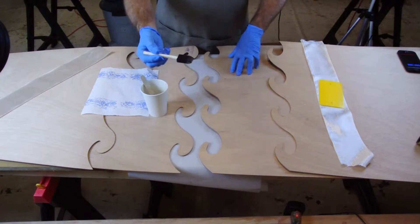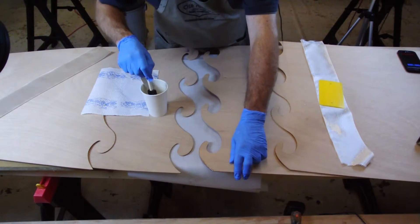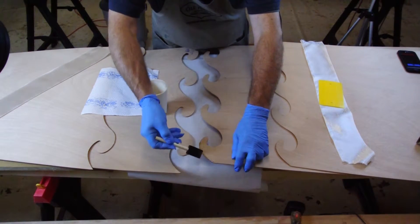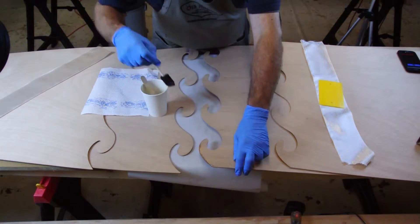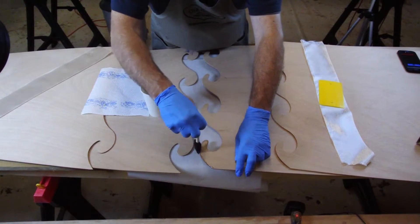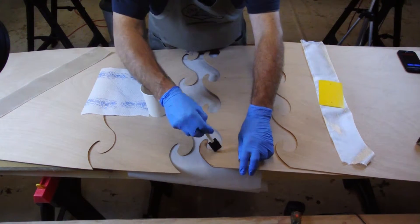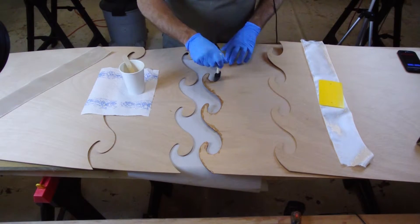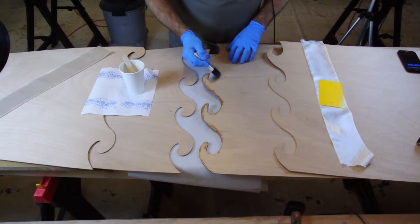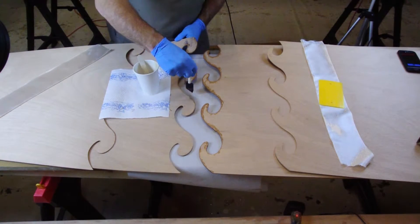You can place a piece of wood under the panel to hold it off the table. Mix up a double batch of regular or non-thickened epoxy. Then using a foam brush, coat the inside surfaces of the wave scarves. Coat them first to wet the edges, then go back and pull your brush across the edges as if cleaning the brush off. This will deposit a nice thick line of epoxy along the inside of the joint.